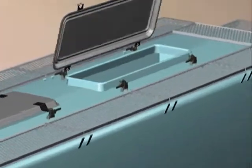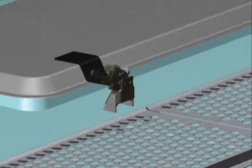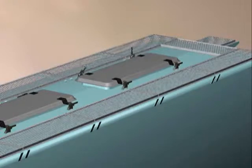The 30311 hatch cover locks require a special hinge pin, part number 30388, to be welded to the hatch cover hold downs. When closing the hatch cover, push the hatch cover down and it will automatically displace the retainer hook. Once the hatch cover is fully seated, the spring-loaded retainer hook will snap back into place and prevent the hatch cover from opening.